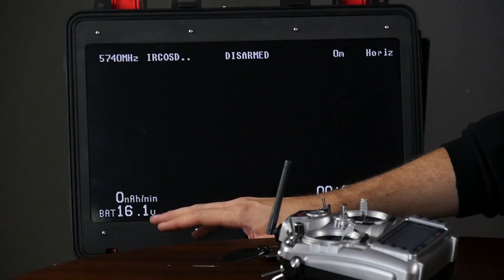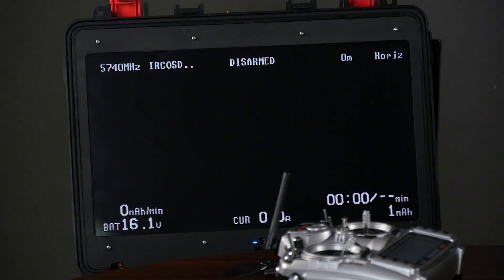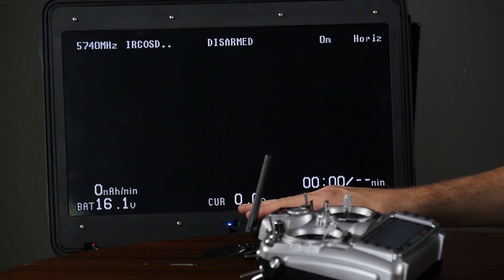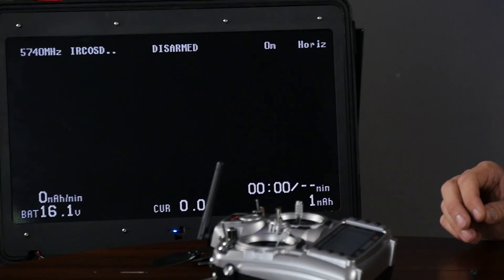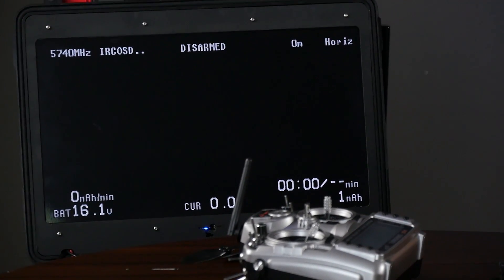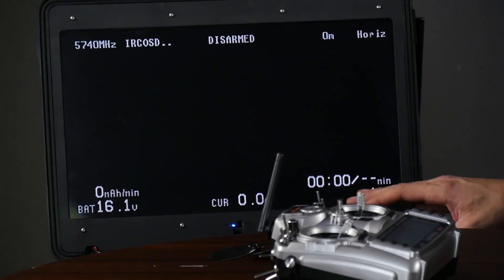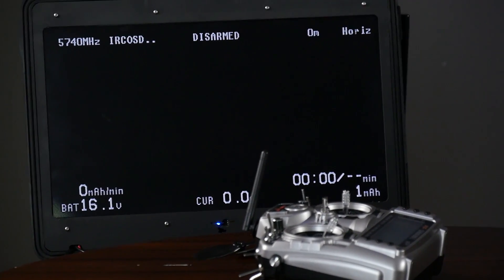The important thing is we want to get you flying. Down here on the lower left, we have our battery voltage and also how many milliamps we've consumed. Current is in the middle — you can go as high as 80 amps. So it's really important that if you're flying a four-cell setup, you've got to have a very high C rating on something small like a 1300 milliamp battery. You've got to fly these things light and with a high C rating. This is kind of like the Corvette of the multirotors.